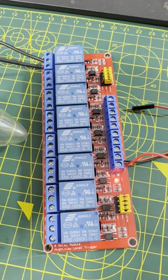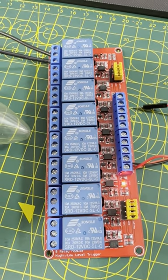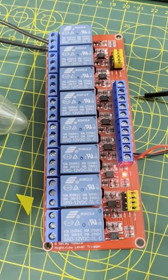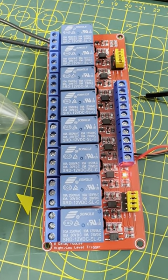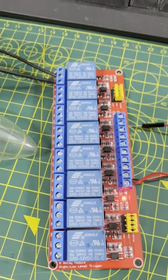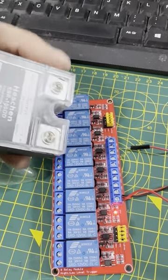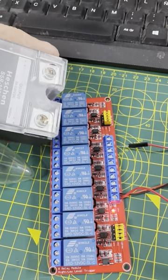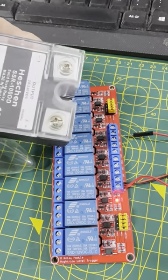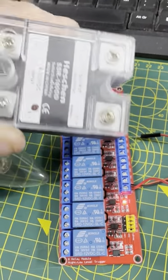So that's it — much easier. The same applies if you have a solid state relay and it needs 5 volts or 12 volt signal. You just apply a small PSU continuous low voltage supply to the signal wire on it. One of these is an example. These two act as a switch, and these two take the low current positive and negative voltage. Whether it's AC-DC, DC-DC, or AC-AC — you just need to check the relay you're buying.